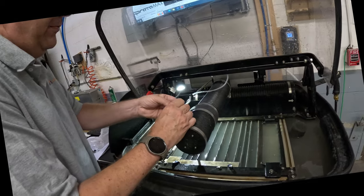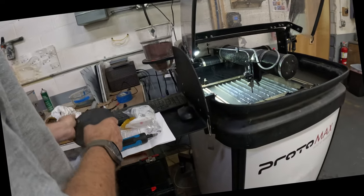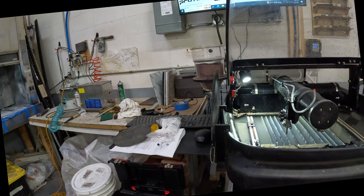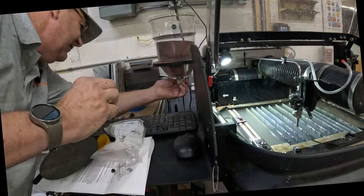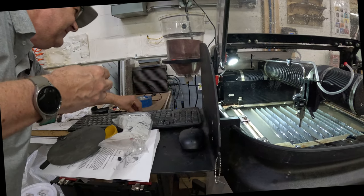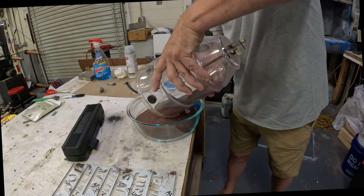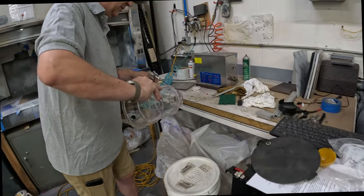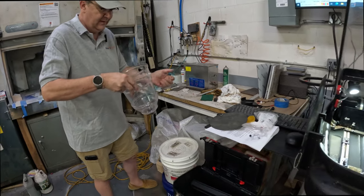Put the cork back in the tip. Because the bottom of the garnet is probably wet as well, disconnect the ground strap, which uses a knurled nut — note it's a different size so don't mix them. Remove the garnet trap and dump all the garnet out. Make sure the bottom is dry — you can run air through it. That looks dry.